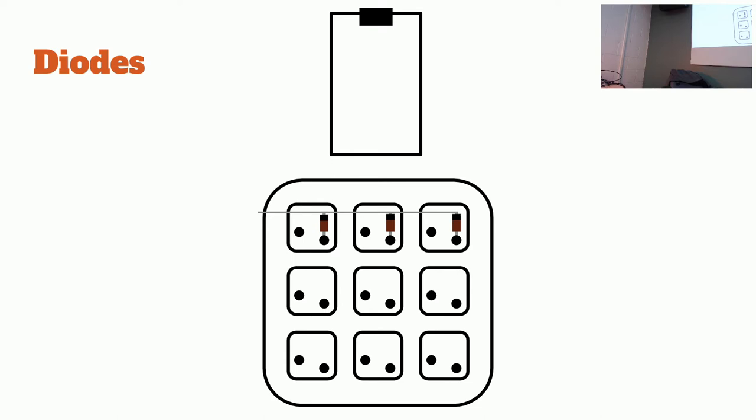So it looks like you've got yours soldered in. Go ahead and cut off the excess leg of the kinked side. That's enough. Is there a certain amount that's needed? No, you can just go ahead and cut all of it, just so it's flush. You just need an electric connection and to have it be as stable as possible.